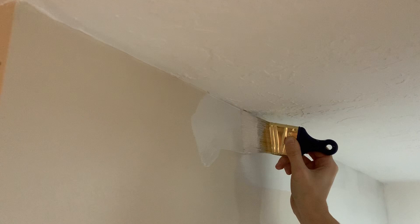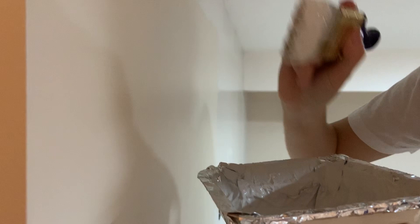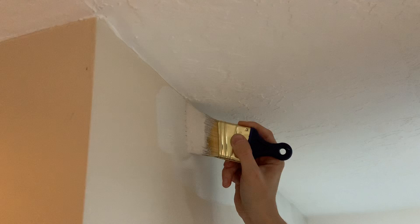There will be a small enough amount of paint that you'll get a straight line without it getting onto the ceiling. When you get close to the end of the line, go ahead and feather down to end your line. You can unload some of the paint by wiping down, and you'll continue that process: dipping, wiping, unloading, slowly coming up, taking your time along this line and feathering down when you're done.